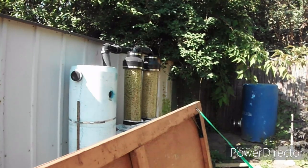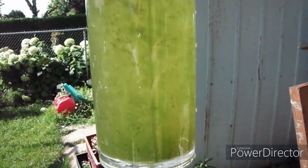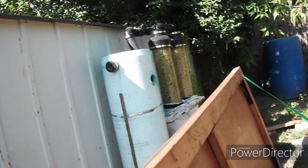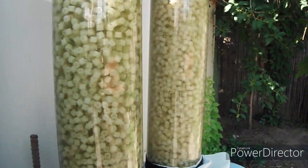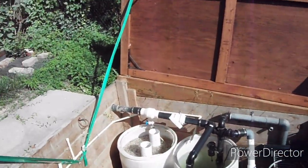The upflow filters have been running for about 20-25 minutes now. I've done one drain and I'm doing another boil on them because they're still quite dirty. This is what came out of the filter for the first dump — you can see definitely some algae in there and the water is very, very green. The K Plus Media is doing a marvelous job at collecting a lot of fines and debris. This is the second boil and you can see just how dirty this still is. So I'm going to let this go again for another few minutes while I work on my float valve installation. Things are running very well in the filter pit while that is going on.